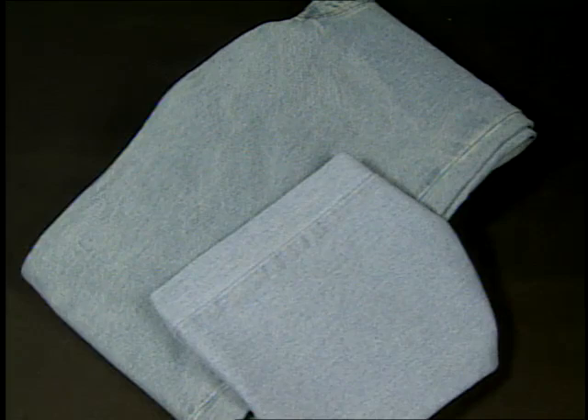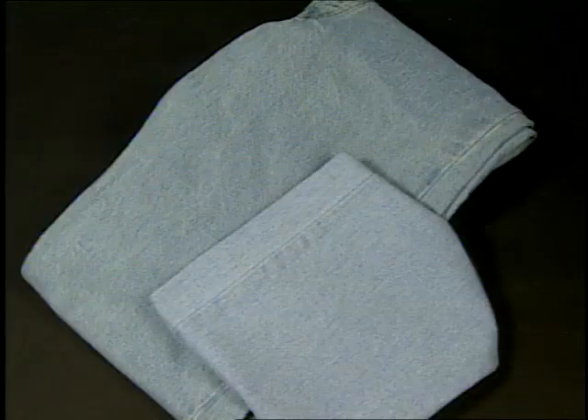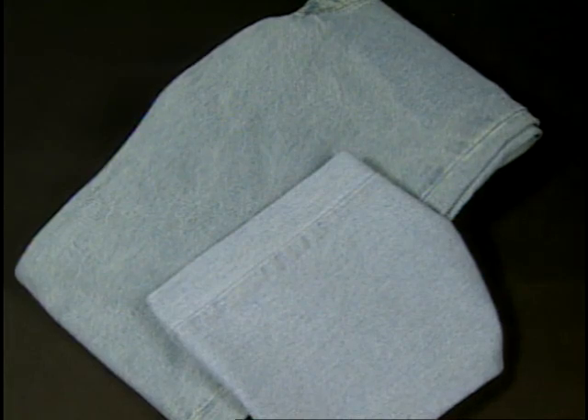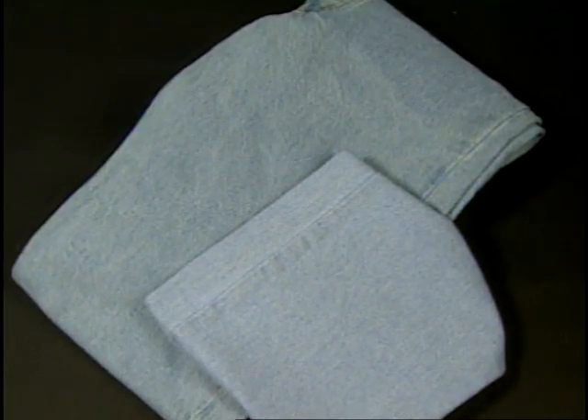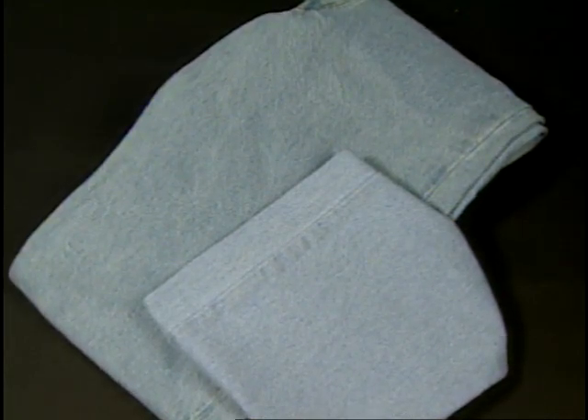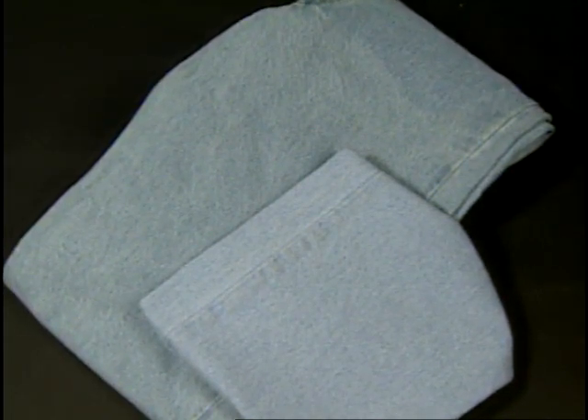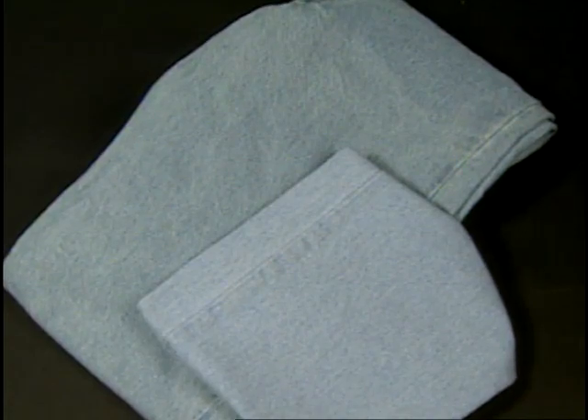After any denim garment wet finishing process, the fabric can be brightened for a cleaner appearance. Top brightening uses sodium perborate in an alkaline bath to create an oxidative scour, adding more contrast between the white and lightly colored areas and the darker areas of the garment. Top brightening is a simple procedure usually applied just before softener application, and a typical procedure uses an alkaline detergent and an optical brightener at around 180 degrees Fahrenheit for 15 minutes.